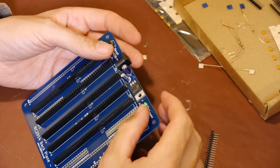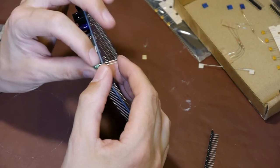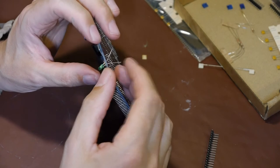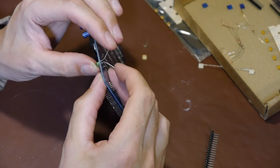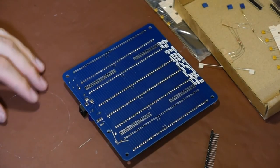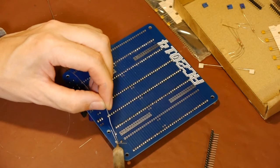There is a little flat on one side of the plastic housing which identifies the cathode, but it's more or less impossible to see. The short leg is going to be the cathode. I've actually been caught out before - I once had some LEDs from eBay that had defied all convention and weren't following the normal polarity convention. Someone had a bad day at the factory.